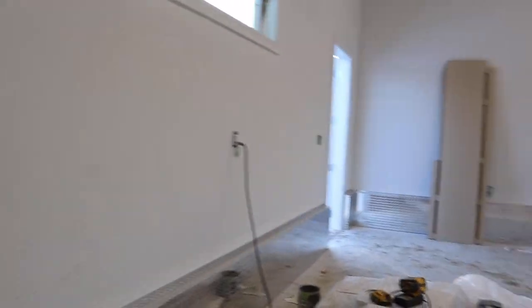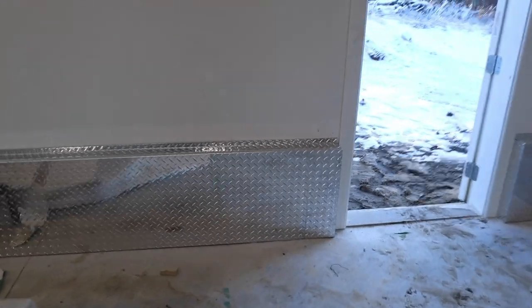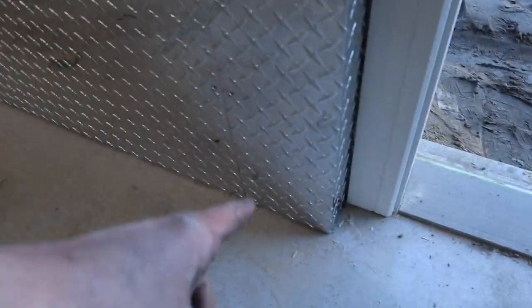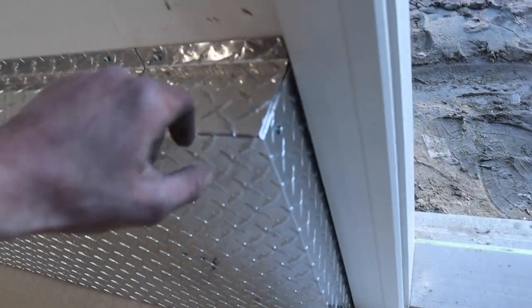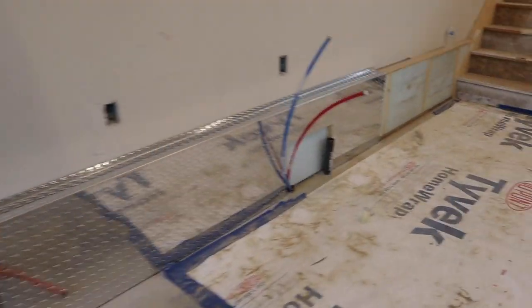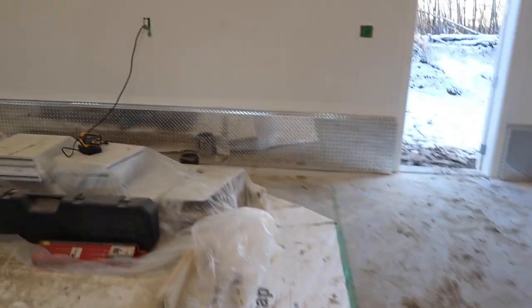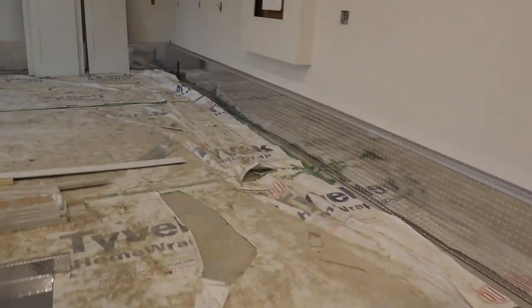Just took about 15 minutes — ran off the whole side. Pretty straightforward. Everything's pre-bent and pre-squared edges for you. All you have to do is take your last piece, bend your corner, and file off the edges. It looks really good. Everything seamlessly flows through. I'm going to cut this piece now and box around that after.